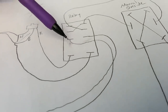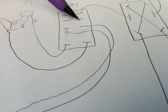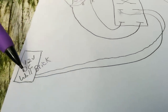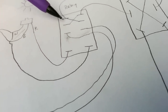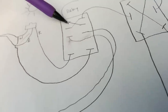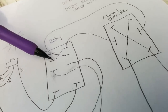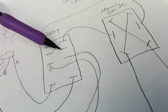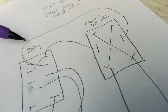When this photo cell triggers, it triggers this coil here, which tells the relay to connect either these contacts together or these ones together. This is your DC power — we've got our DC brick coming into our relay as the source, and we're just switching between either of two contact pairs. You'll have positive here and negative here, and it'll switch to the other pair, reversing which contact is positive and which is negative, because we're just switching which contacts are active.